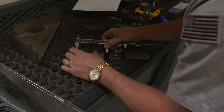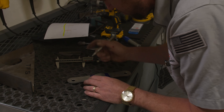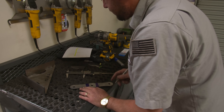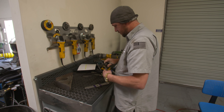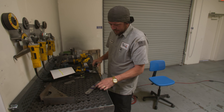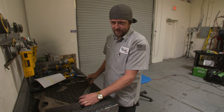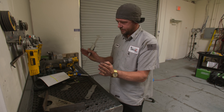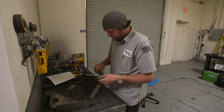Now with the distance set correctly from the top down to the brake point, I'll make myself a little line there. I need 7/8 of an inch from the top down, which is one break, and then 3 and 7/8 from the other line, which is the other break. Those are on opposing sides, so when you break it upwards and then downwards it'll come in where it's supposed to.